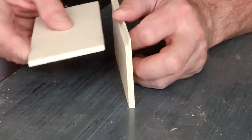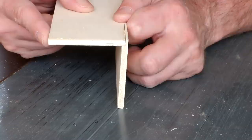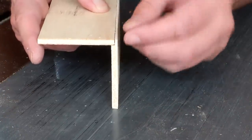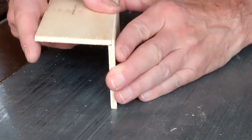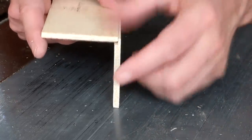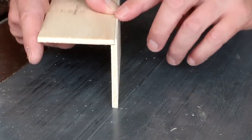The main thing I want to check is this dimension. I've got another piece — this is actually the side of the tray — and I can drop it in here and see how well it fits. That looks pretty good. I don't think I need to make any adjustments there. If this thin side is protruding a little bit, I'd rather have that than have it fit too deep, because in that case I really wouldn't be able to sand the whole piece down to get it even. But with it sitting slightly lower, I can use my sander and sand everything flush really easily.